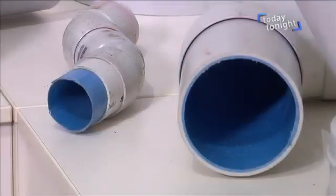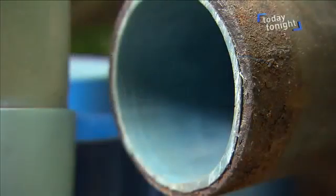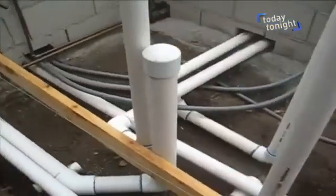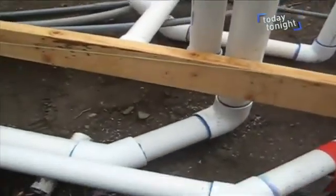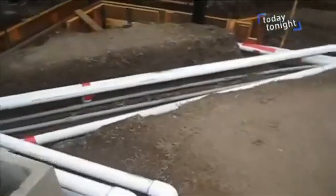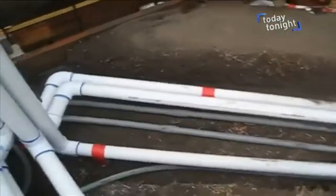The system varies depending on the pipe size and the number of bends. Although Ed's company has relined pipes for nuclear power plants and sewer systems in India, the toughest fix has been the backyard swimming pool and the humble Aussie bathroom. In pool pipes, it's a pressure system with very tight bends. To pull a bladder around multiple bends — from your pool box to the pump — could be up to 10 bends, and it takes some resistance.